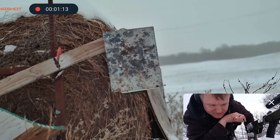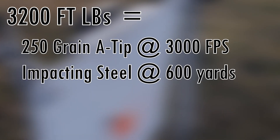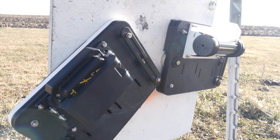Still no visible damage at 3,200 foot-pounds. Now 3,200 foot-pounds is a fairly significant number for a plastic plate to deal with. For example, 3,200 foot-pounds of force is what a 250 grain bullet going 3,000 feet per second will end up being at 600 yards. So on your average day, this plate can take a direct hit from a light ELR cartridge at 600 yards. Pretty impressive. A lot of people doubt that 3D printed plastic can survive any kind of real-world application, and I think this test proves that wrong.